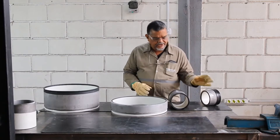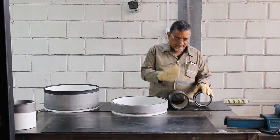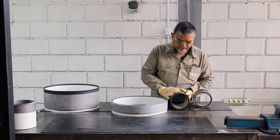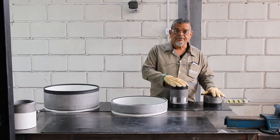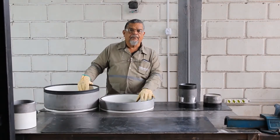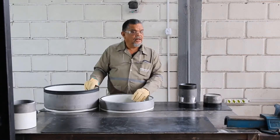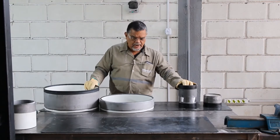I mentioned the challenges of design. One of the biggest challenges was to design something that was practical to use in the field. We could not come out with a contraption that takes forever to install or that costs enormously. So we had to come out with an economic and practical way of achieving our engineering goals. As we can see here, we have systems for small pipe — this is for a 6-inch pipe. We have systems, both ring and sleeve, for big bore pipe — this is an 18-inch set. 18-inch is not our limit; we can go much larger. 6-inch is also not our lower limit — we have systems designed for 4-inch pipe.